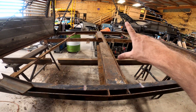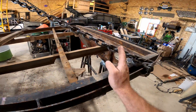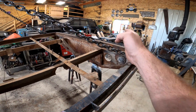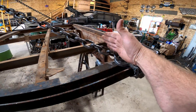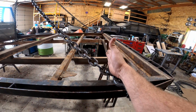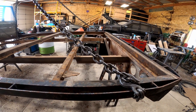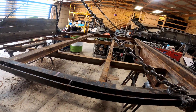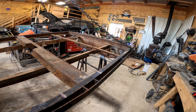Essentially right here it'd be the inside fender well — we've got to make a fender well, and by using these two pieces of channel we get our thickness difference. This piece in the middle is in the way — if that tire is right there it's going to rub, so this has got to come out. It's too weak anyway. Need to fix that hole, fix this gap, get some structure back in it, then start putting in new cross members. I'm still contemplating dovetailing it, but I'm gonna cut this off right here, fix all these issues, set it on the truck, and make a judgment call from there.